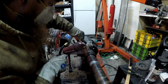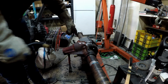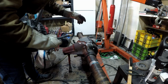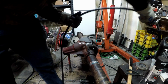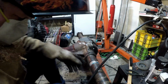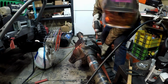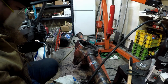I don't know if you can see this tiny little hole right here. I don't know why that hole's there, but the plate doesn't match up perfectly. So I'm gonna actually tack weld into that hole, and hopefully that'll give me a little bit more resistance to blowing through right there. Four nice meaty tacks. Oh, this welding cord is all over this camera. Boy, is it hot back here. Nice. I'll never see that again. Alright. Let's get to welding.